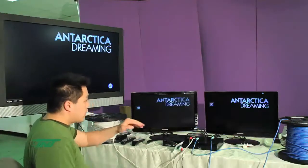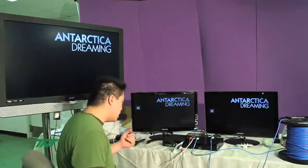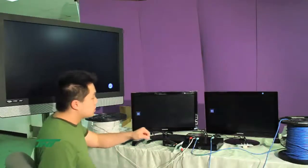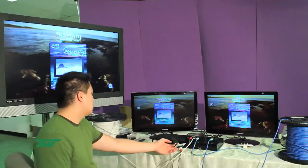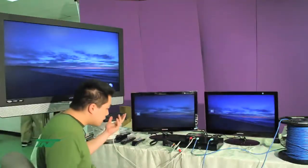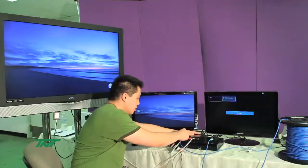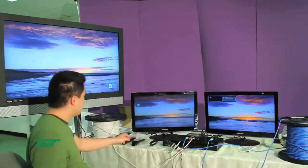Let me reiterate, for these I'm using 500 feet each, since it's composite. And I'm using 3 different receiver units: a box style, an RJ45 wall plate style, and a pigtail style. We also have a 4th style, which is just a 110 punch down wall plate, but I haven't been using that because we don't have the monitor for it. You notice I have connected ports 2, 3, and 4, but if I switch any one of these to port 1, it still comes up. So all 4 ports work with audio too.